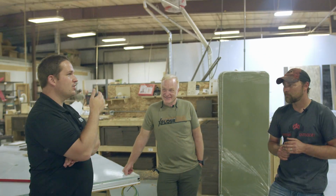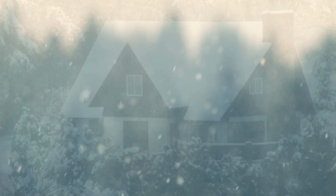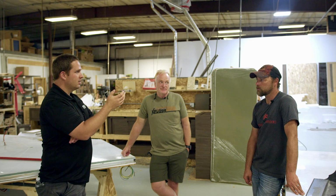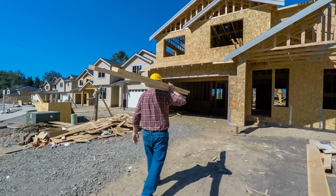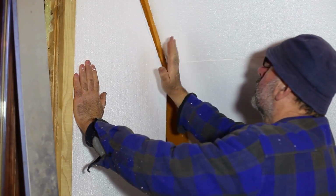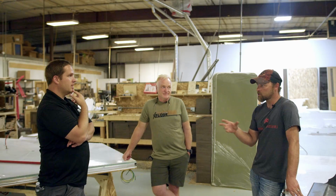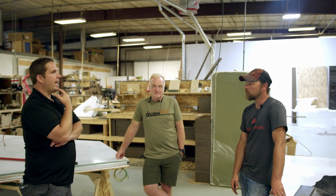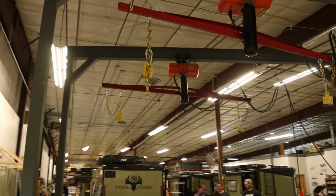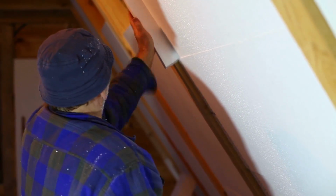And I guess that's the difference when you live up here and you build cabins. You worked in building cabins, residential construction, cabins and homes. And as a builder, I had never heard of how you weave the insulation for studs. And you've got a thermal bridge. Any stud, no matter what material it's made out of, is a bridge. Yeah. And stopping that bridge is key. You see it in the construction of this building. You don't see any of the framing, because they've got to stop that thermal bridging, you know?